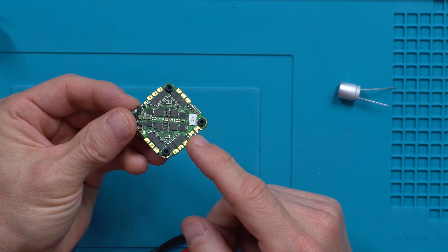Take the spacer piece, stick the flat side on top, and grab the mini screws of the perfect length. It's my first time working through all these different screw sizes — probably should have written notes, but you live and you learn. Everything looks great — all bolts are the perfect length with no extra protrusions that could accidentally contact the flight controller or break a chip. The USB port is up on this side. The flight controller underneath is like a diamond shape, and the air unit on top is more of a square, with the camera facing perfectly forward, the antenna heading back for the video feed, and the wire running underneath between the two.